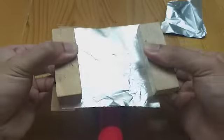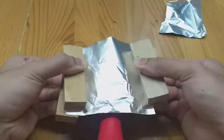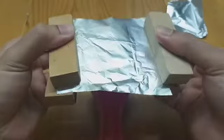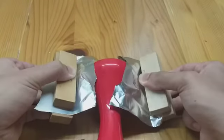The amount of metal stretching is very important. If there's not enough stretching, the sheet metal will not take the shape of the die. If there's too much stretching, we run the risk of tearing the sheet metal.